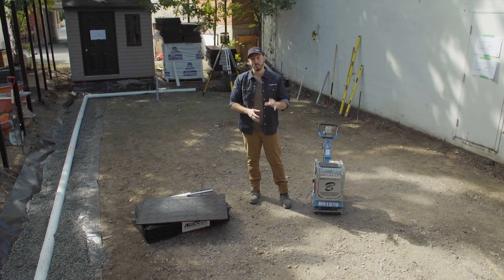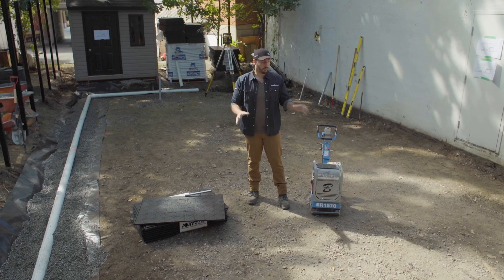In this case, we're working with a sandy gravel mix, so we won't have to amend. We can proceed with compaction. But before talking about that, I do want to draw your attention to the excavated area and excavated depth.